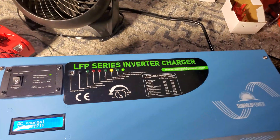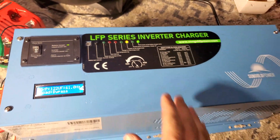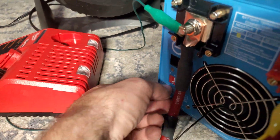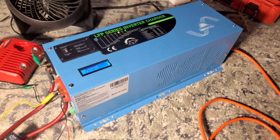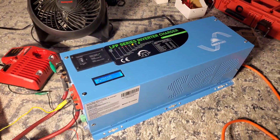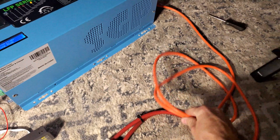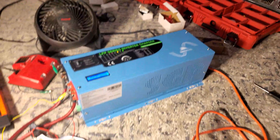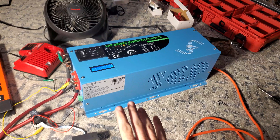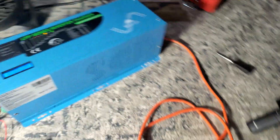So that's a demonstration of how this inverter works. The charging seems to work pretty well. To stop it from charging I just unplug it — flipping the dip switch back didn't seem to do anything, so I may need to power-cycle the inverter. The cool part is that as soon as you plug this into the grid the inverter will start charging the battery bank. And when you have it plugged into the grid it will basically bypass the inverter and power all your loads off the grid, while continuing to charge the battery bank simultaneously.